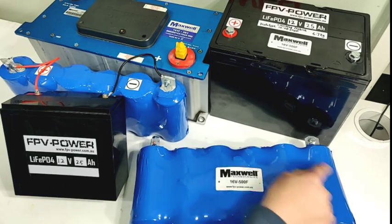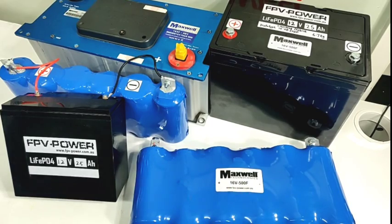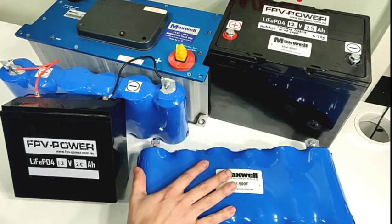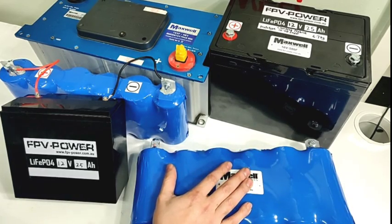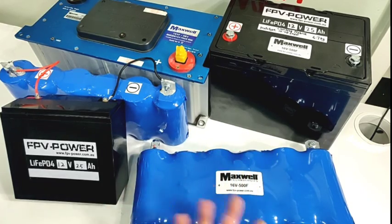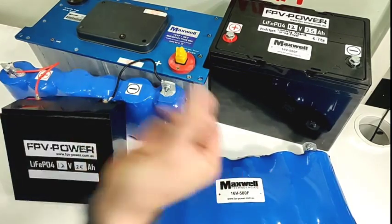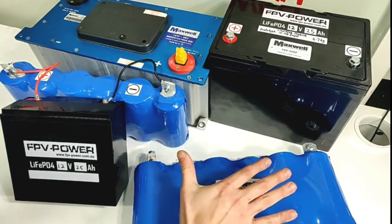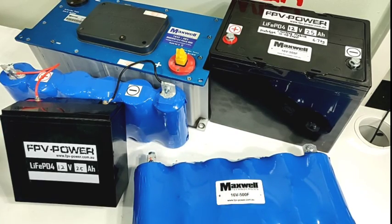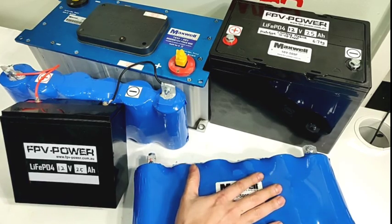So at 3 watt hours, if you talk about amp hours, it's nothing. Could be less than 1 amp hour. So in other words, if you install one of these in your car, for example, I've got a 3-liter V6, a Toyota Estima, which is like the Toyota Tarago. It's an import, and it's a V6 Camry engine. That would turn it over like that. Not a problem. But if I were to only have the supercapacitor, and let's say I leave my headlights on and walk away, within 5 minutes, this supercapacitor is dead.